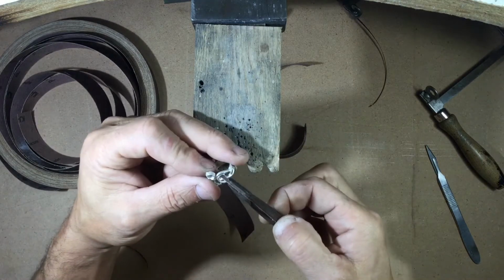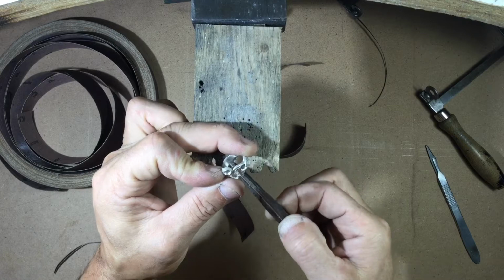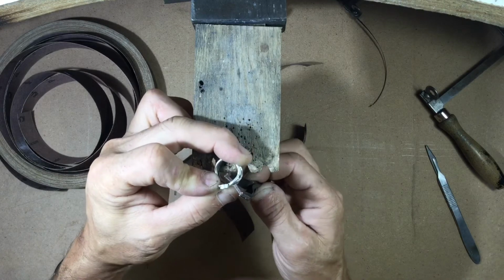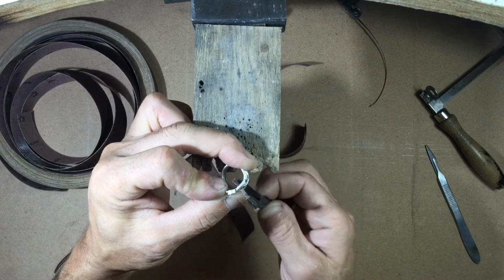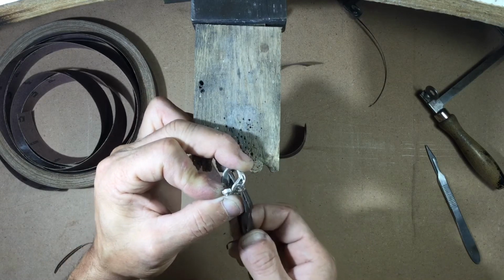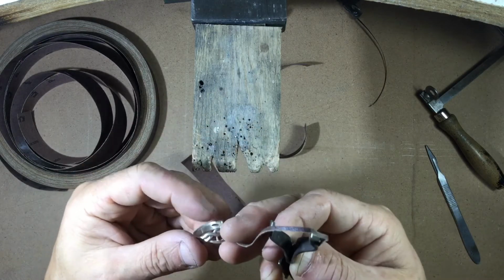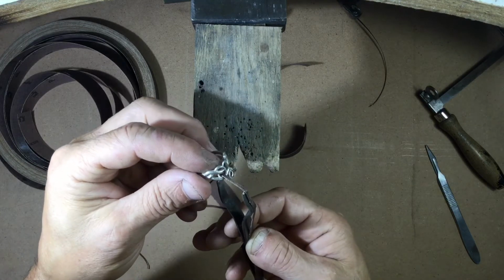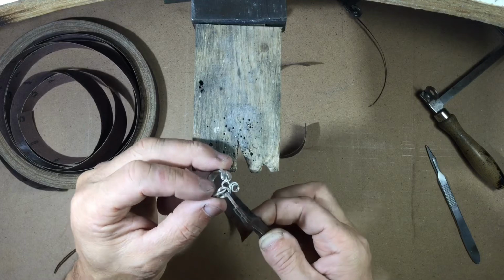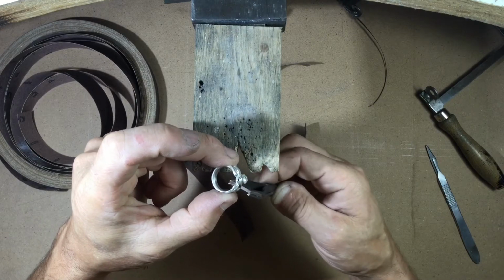And now I can hold it, and you can see how the cross-locking tweezers let me get right inside. And so I can just sand back and forth. I'm changing my angle of attack so that I sand around the edge. The nice thing about this is, to change it, I just release it. I'm going to turn it around the other side so I can do the other side of it. I just grab it, put it in the notch, pull it back down, and tighten it. And then I can do the other side. And again, you can see I've got that much swing.